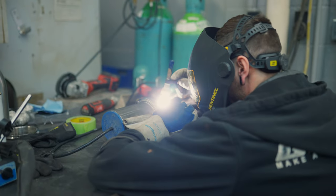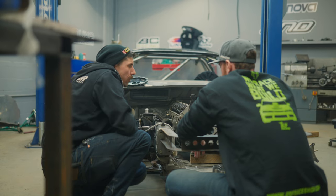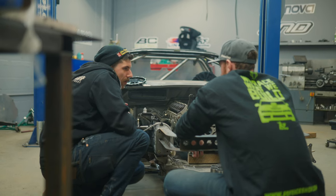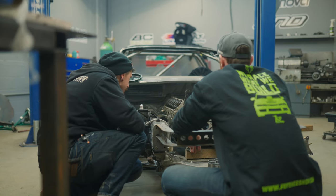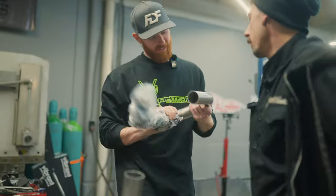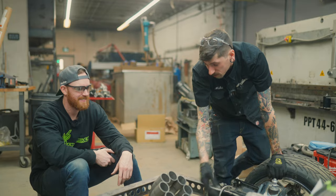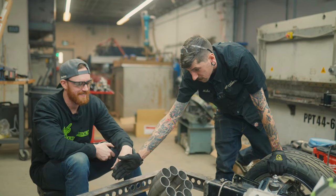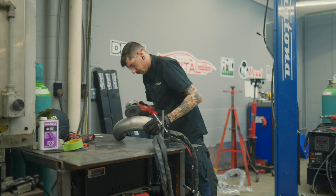So pretty much showed up and kind of had a plan that we've been talking about for a long time. Spent the majority of the morning game planning what bends we're going to need. Then I just sliced up a bunch of bends in a box I got over there that I'm going to take home after and bring with me and swage them up a little bit, because of the oval on the bends. We want them to fit the head flanges nice and perfect at 2 inch. We don't want it like 2 inch-ish.